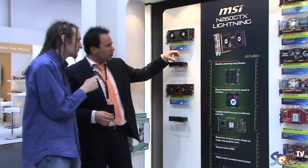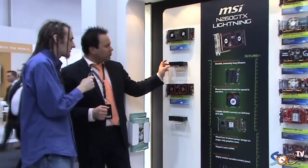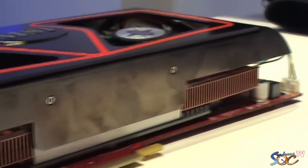As it's USB, you need a special software which interacts with this panel. On the panel you can change the core clock, the memory clock, the shader clock, and also the voltage. There are also special settings for power saving, because VGA cards always use a lot of power and not everybody is always playing games. With the power saving modes you can lower down the power usage. Green power is actually the way we optimize the PCB so the traces don't leak power.